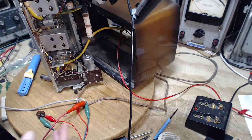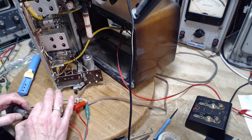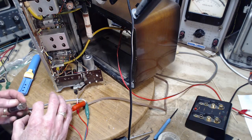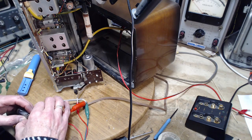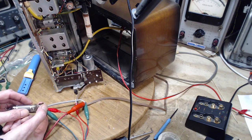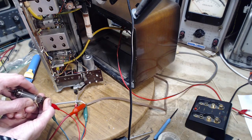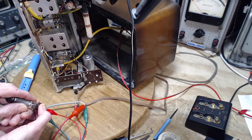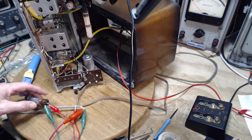And plugging the tube in should short them out. And as I push the tube in deeper and pull it out, that short would come and go if there's a problem. So there'll be some initial contact here. There, it's gone. I haven't even sunk it in yet. It says something about the quality of the contact, and I'm not even shoving it. Okay, now we're going to shove it in. Listen carefully. You hear a thing. Silence.